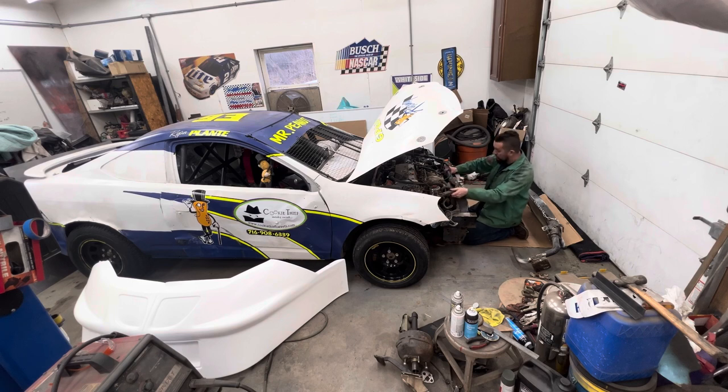I'll shape the bar and slide it up here — maybe put a bolt through the fender to attach it, or tap-weld it up there, but I'm not going to solid-weld it to that upper rail. On the Cobalts I put two pipes down from the upper bar to the front bumper; on this setup I'll probably do two in the center and two out at the bends down to the bumper so it has good support. It won't be tied in up top, but it still gives protection over that radiator.